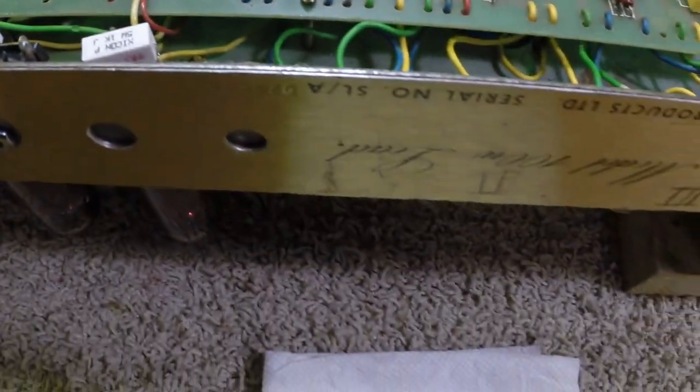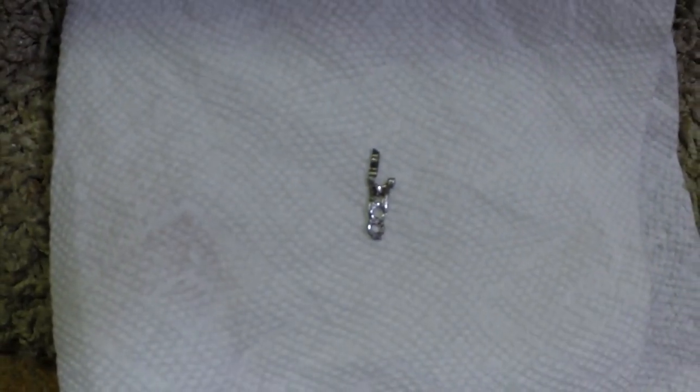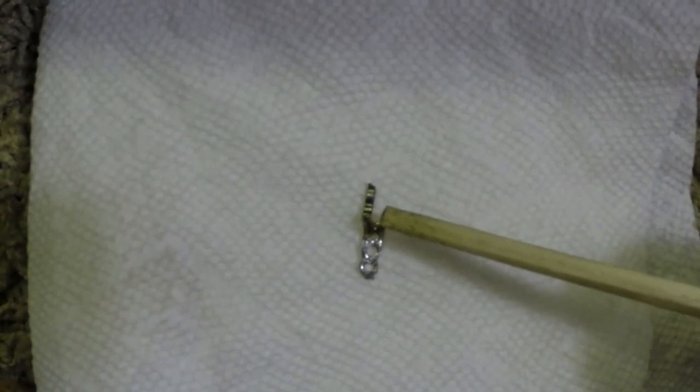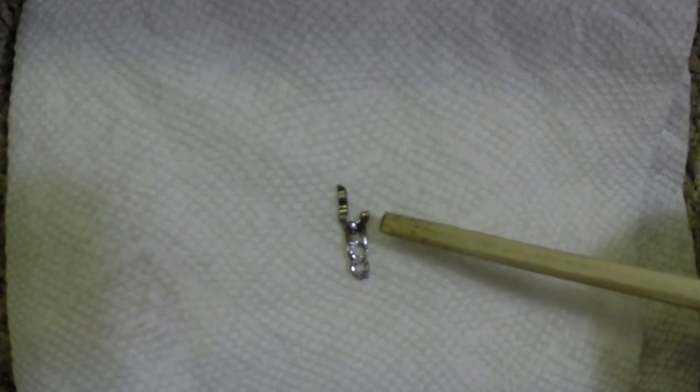What I found — gotta love this. Do you know what that is? That is one of the pins out of a tube socket. Guess which pin it was — pin five. That's where your signal and your bias is. This is supposed to be a forked-looking little deal, with one on both sides, and your tube pin slides down between it and makes a connection.